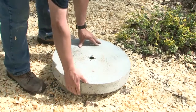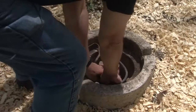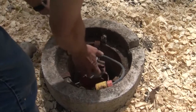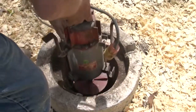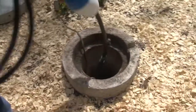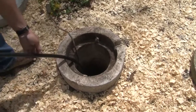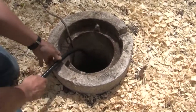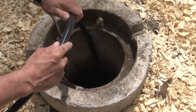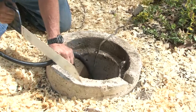I've got it cut off. I'm going to set the part to the side and unplug this aerator. I know the power's off because I have it cut off at the timer in the building. I'm going to stick my diffuser in there — it drops down in there. It's a weighted diffuser that hangs from a float. I'm going to cut the cord where there's a little extra so I can make my connection to my pump, and I'll take my saw and cut it to the length I want.